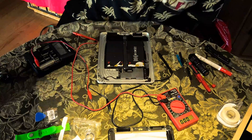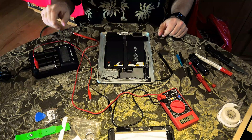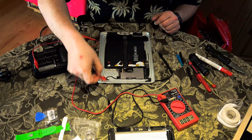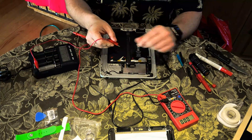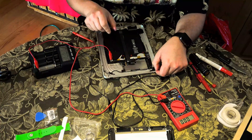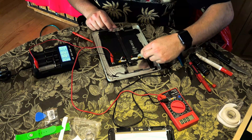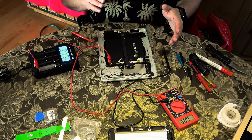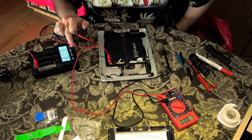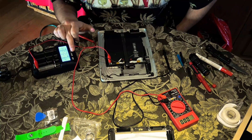I have a special benchmarking lithium charger here that will charge just about any portable-style cell. I'm going to use this to put a little juice back into these batteries. I have a small adapter with alligator clips. I'll clamp one on a terminal and connect to another one — being careful not to touch any surrounding metals so I don't short anything out.